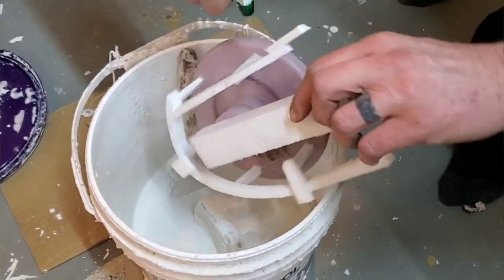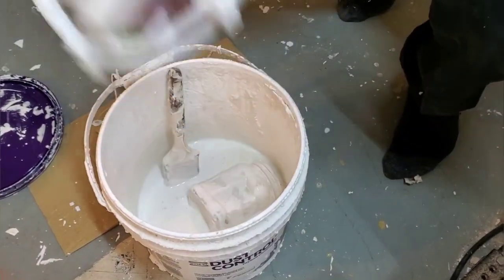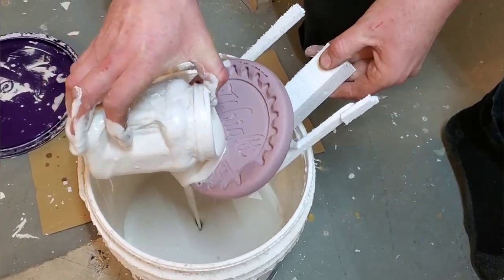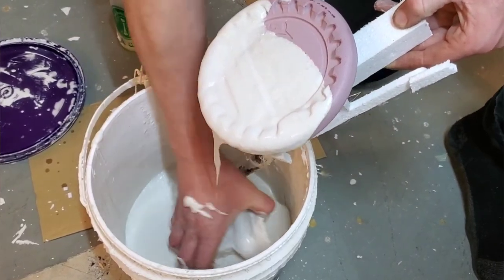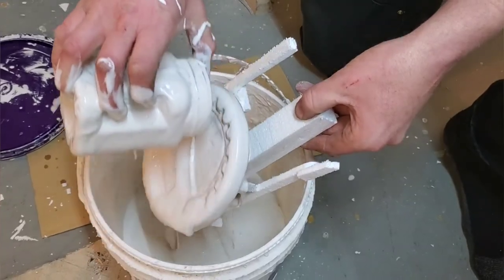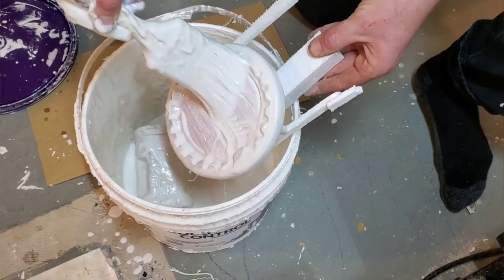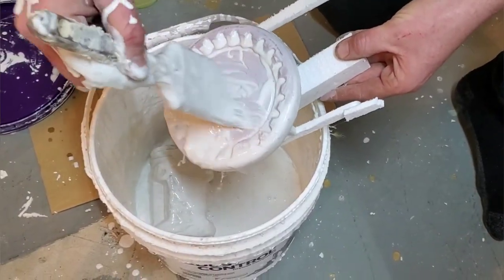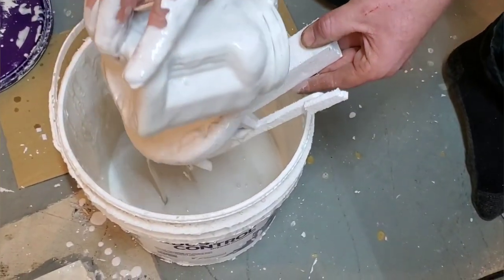I did have a comment from one of my viewers who does lost foam casting as well, and he said I need to thin down the plaster a little bit — and in my next videos I will thin it down and give it a whirl. This still does work out but I need to make sure I dry it for an ample amount of time so there's no moisture in the mold at all. I did find some air bubbles still hiding underneath, so I run the brush just over the top to find any that were missed. If you look at the final casting you'll notice I still did miss a few, so I think I'm going to try thinning it down next time to see if that makes a difference.